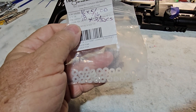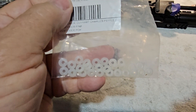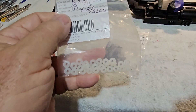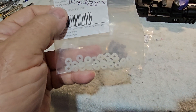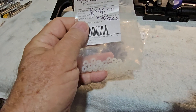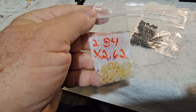These work perfectly, first time every time, never a problem. The valve rod slides through this o-ring nicely and just tight enough - not too tight, but perfectly tight. I've never worn one of these out. They might eventually get dried out and hard after enough years, but so far that hasn't been the case. I strongly recommend these over the ones from FX USA, which cost several dollars a piece.